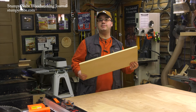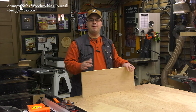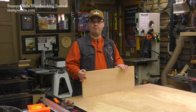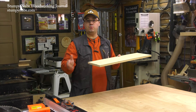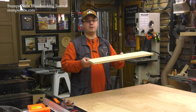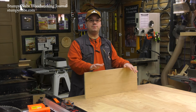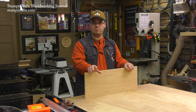For some reason, working with plywood seems to make some folks forget that certain cuts should be made with the rip fence and others with a miter gauge or sled. Maybe we just get caught up with all the cutting and rotating of project parts and it all just seems the same. But there comes a point where it's not safe to use a rip fence anymore. As a rule, if the length of the edge that's against the fence is shorter than the distance between the fence and the blade, you won't be able to keep that panel from twisting and potentially binding during the cut — maybe with dangerous results. So get out your miter gauge or your crosscut sled and make the cuts the safe way. Other than that, plywood is much like cutting solid wood, with the same tear-out and other issues that we covered in previous parts of this series.